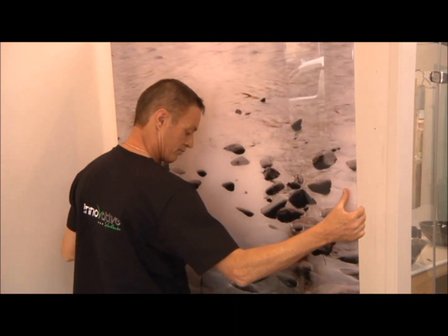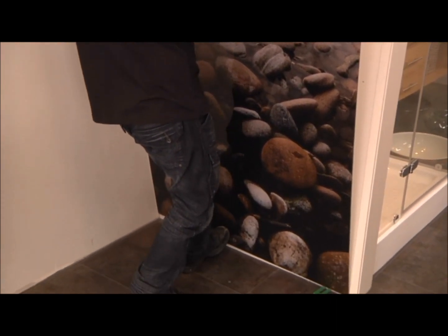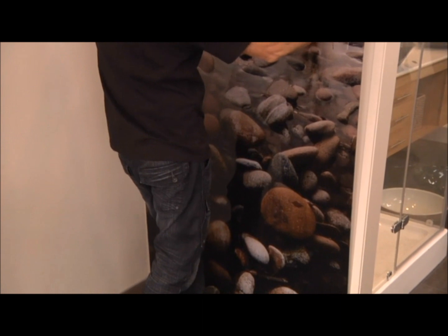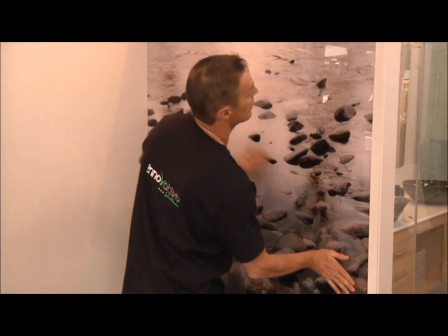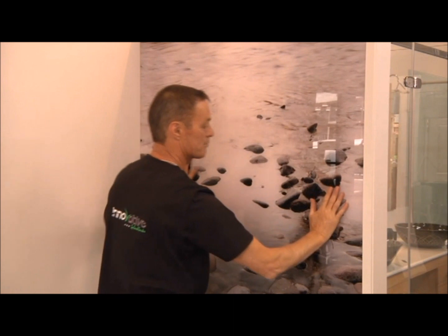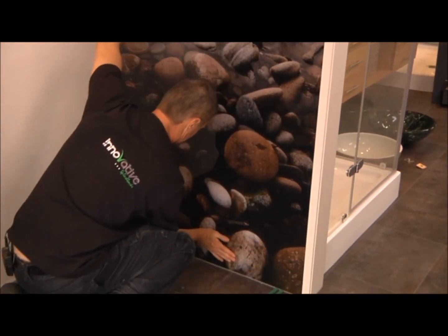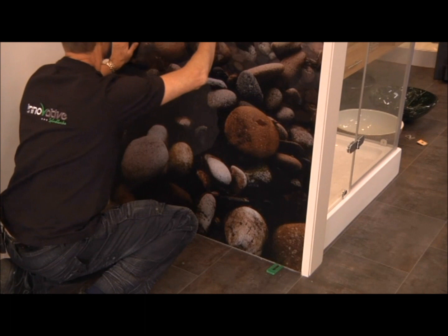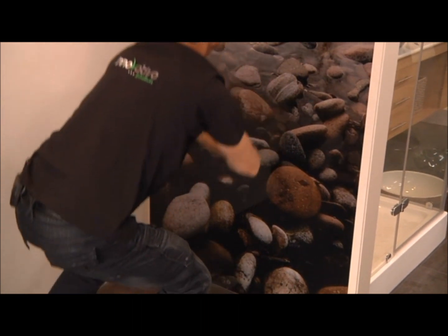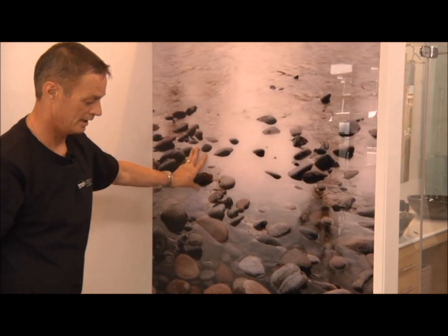We then place our sheet, lift it up, we can see our packers. We know that that bottom edge there needs to slide over that way a little bit. And we can proceed now to push our sheet back. And then we grab where it's siliconed, and we just make sure we get that good and clean, make sure it's in at the bottom, and the silicone's adhered all over. And there we have our sheet fitted.